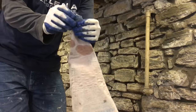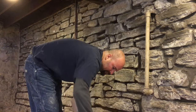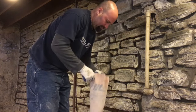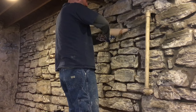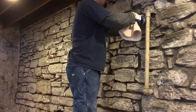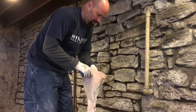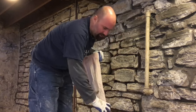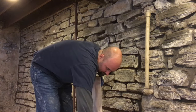I've cut the tip off the grout bag at an angle so you can tuck it in there more easily. You go constantly squeezing it out — you've got to do this a lot to get it all out. If you've got a bunch in there and put more on top, it creates an air pocket, and when you're squeezing it'll pop and sand will get in there. That's happened more than once.